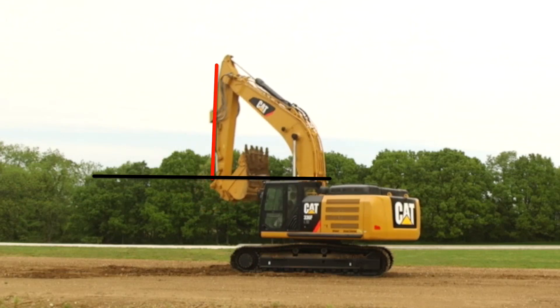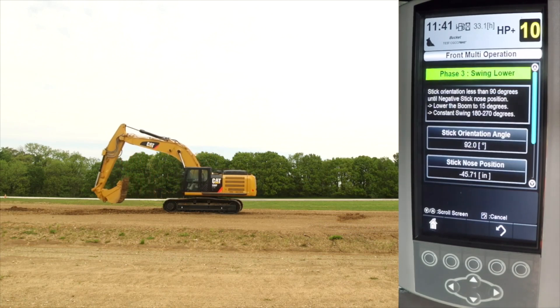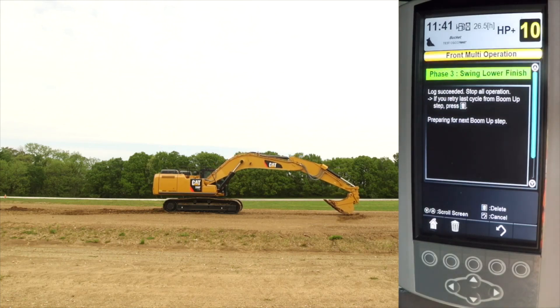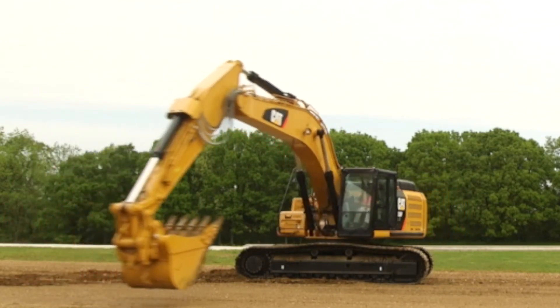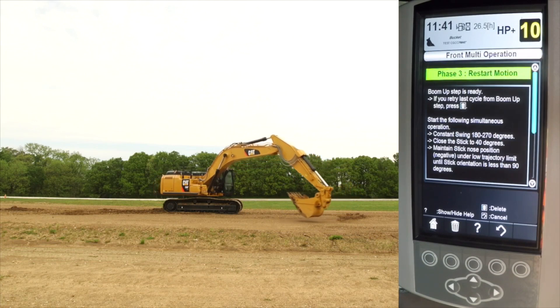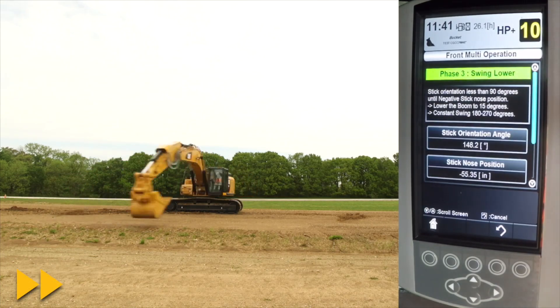Stick in at a comfortable speed and match the boom command to maintain consistent bucket distance above the ground until inside vertical with the stick, then raise your boom. Once you have a successful calibration, repeat that on your way out: lower the boom while extending the stick and swinging 180 to 270 degrees back to the starting point. Keep the bucket pin above the top of cab plane while the stick is inside vertical — a more aggressive boom movement at first followed by a more aggressive stick movement to finish will yield a successful calibration. Think of it as tracing the ground until the stick is vertical, then come up as close to the cab as you can. Repeat until the system has logged five successful passes.